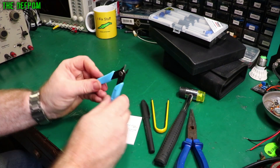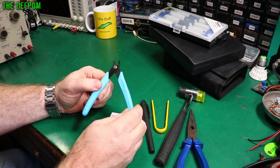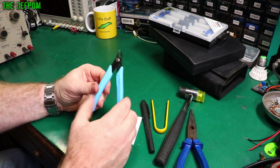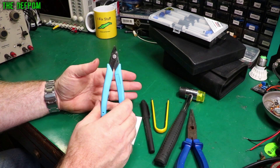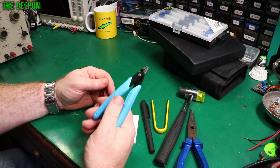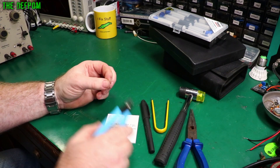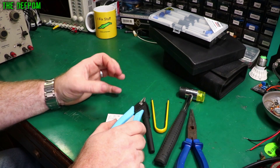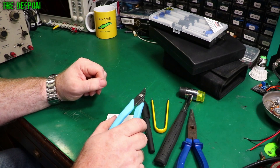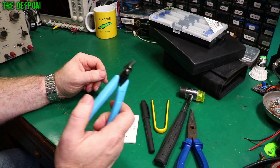Side cutters — you're going to need some side cutters. The ones I carry for my 3D printer are okay, but I suggest you get some decent side cutters for electronics work. You need to cut component legs, wires — these are only meant for really light duty work. You probably want a couple of different sizes: a small one for finer work and something a bit larger for cutting bigger wires or anything more heavy duty. You don't want to be trying to do heavy duty work with fine side cutters — you'll end up breaking them.